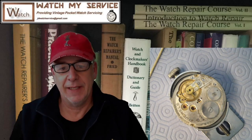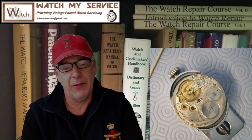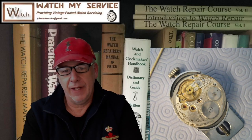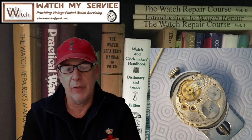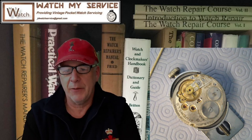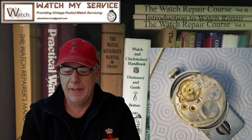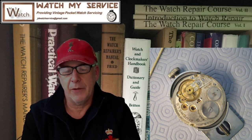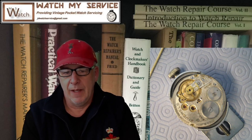Alrighty then. This is the final update. I've been playing with this hairspring for around an hour. So hairspring work is not fun at all, but I've managed to get this watch running fairly well, compared to the way it was running before. I don't know if it'll ever be perfect, but it's running now. It's got a bigger amplitude than it had before, and I had to do a lot of playing with the hairspring because the hairspring touches the arm on the balance and you get all kinds of other problems. And I had to re-stud the hairspring as well, which is not fun.